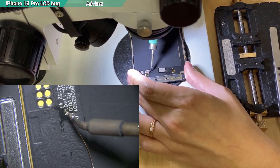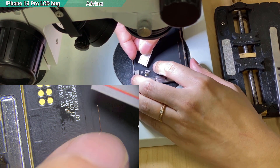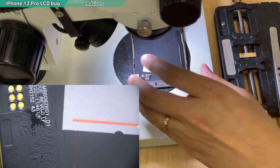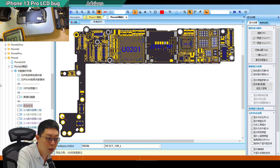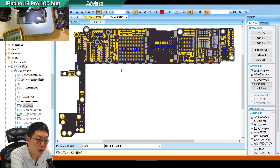I will remove this jumper carefully and set it aside. In my experience, a direct jumper won't last very long. Somehow, one day it will become broken again and might not be recoverable anymore. I've seen quite many cases where a direct jumper doesn't last. It's best to add a resistor between, so whatever happens on one side won't kill the other side — at least you have some protection.